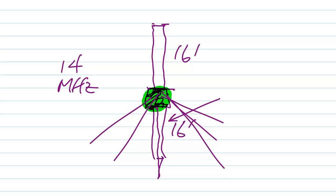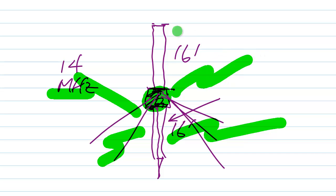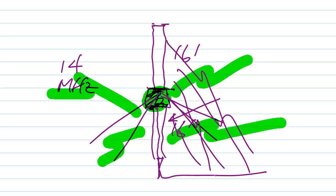I don't think you're going to see antenna currents on that coaxial cable, because inside of the tubing no radiation can take place. The radiation from this antenna goes out into space. It can't occur inside the conductor itself. So you should get no effects on here, and in fact get no antenna currents on your cable, as long as you obey that rule to run it straight away from the antenna. You don't want to run your cable out like that, because then you will get antenna currents induced like this, and that's a bad deal.